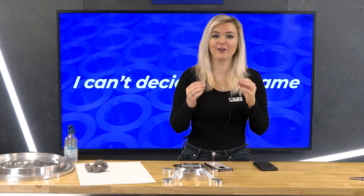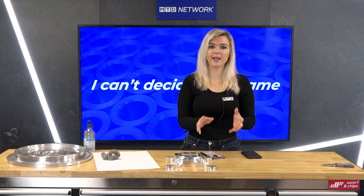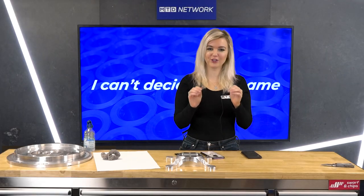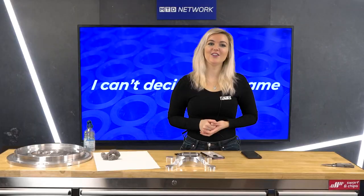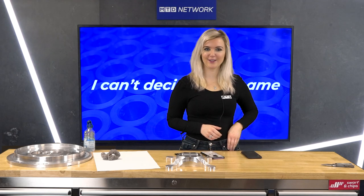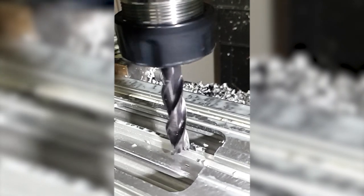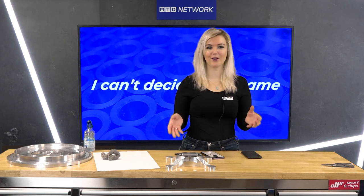Slow-mo of the week is from Clive Glossop again. This was machined on an XYZ 500 LR milling machine, cutting some pockets in a Bosch Rexroth aluminium extrusion, using a 3-flute 14 millimetre aluminium-specific end mill supplied by Cutwell Limited. Your selfies are in with the goodie bags — check out these pickies, I'll be really happy with your prizes.